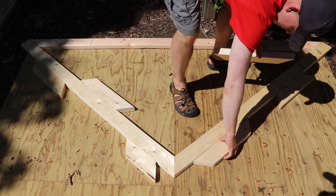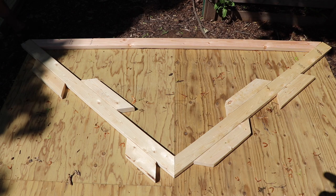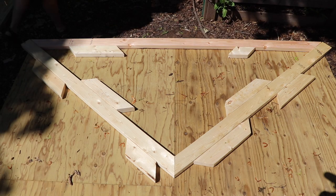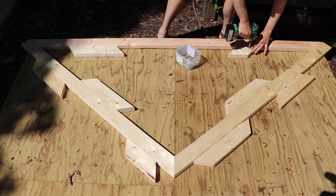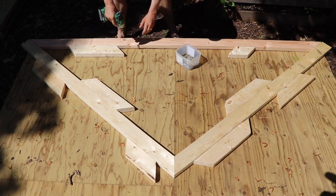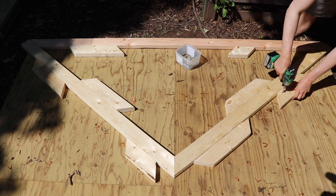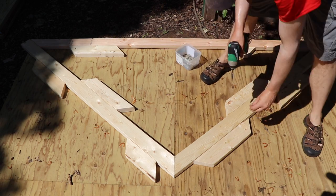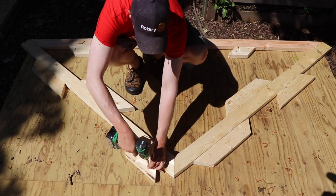You line up the points on the bottom, and then you line up the bottom of the top rafters here, and they should end at the very bottom corners on the floor. Isn't that convenient? And then you put your crossbar down there, and bada bing, bada boom, everything lines up exactly how it should. So once you've got them lined up, I used some scrap two by fours, and I screwed them into the floor, made sure it was nice and tight, and I used that as a template to slide these out, slide the other ones right in, and get started. You can repeat, and you know they're all going to be exactly the same.